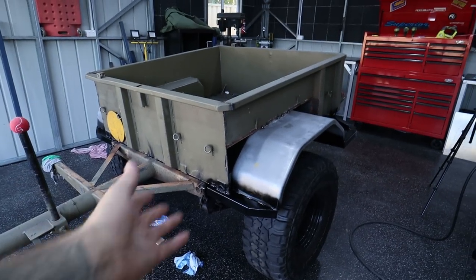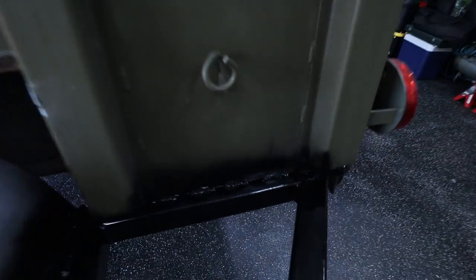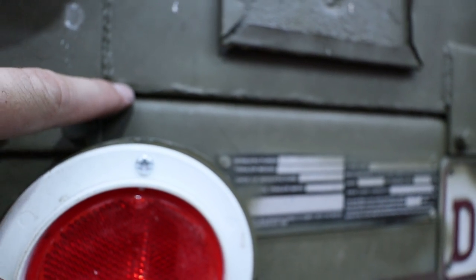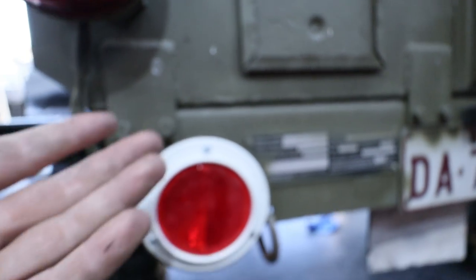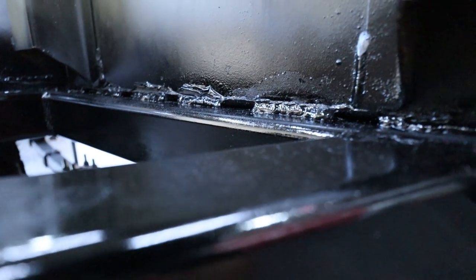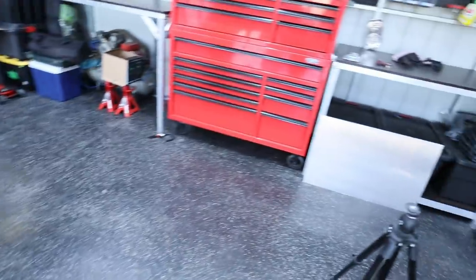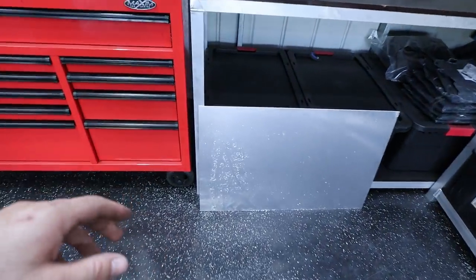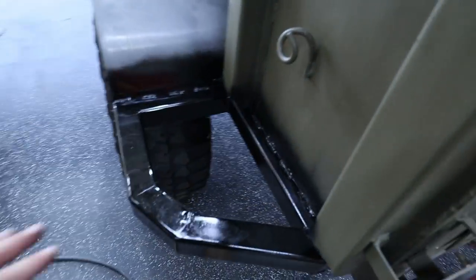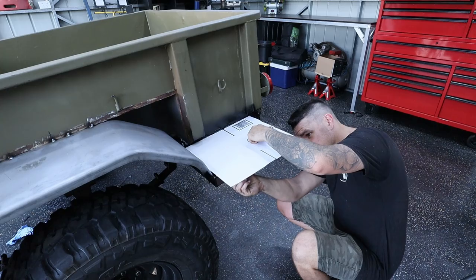This is now fully welded on the slider department, so that actually went really well. Because the trailer has its own little box weld, I actually can weld to the weld, which actually makes it like a thicker weld. So these are some bloody thick welds and they're gonna be nice and strong. The next step is to just quickly sheet it. Now that shouldn't take too long, hopefully, but I have this 3mm aluminium plate sitting here ready to go. What I'm gonna do is cardboard template the top of this, cut it out of the aluminium, then we can pop rivet it straight on.